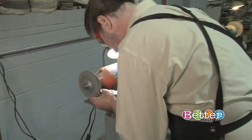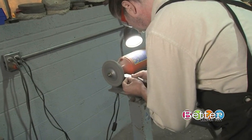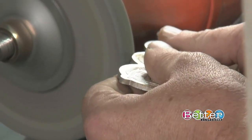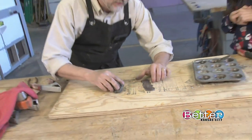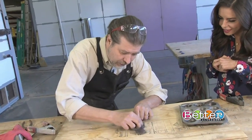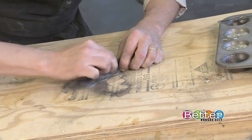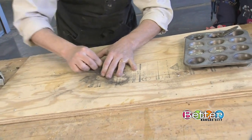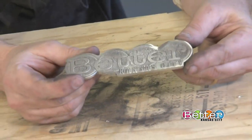What kind of look are you going for? We're going to finish up the edges so that they're all shiny and pretty, and then we're going to make them look dark and antique. So we're going to be cleaning all of those tool marks up, making a nice smooth curve on the top of all these parts. I'm using a little quadruple-ought steel wool to take that black residue back off of all of our highlights — just using a lot of elbow grease to shine things out. I like what the steel wool does — it gives it that sort of antique luster. A little bit about Dave: he's a bladesmith and a blacksmith, and he also has a degree in design and has helped build robots professionally, which led him to create this process. And again, this is the Better Kansas City logo that you just saw.